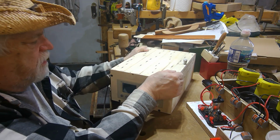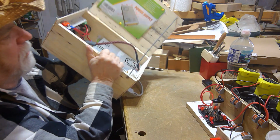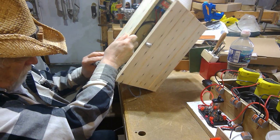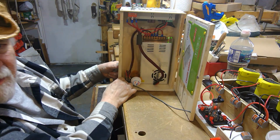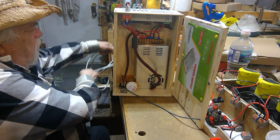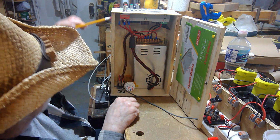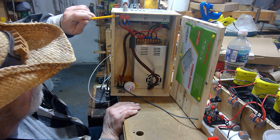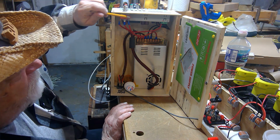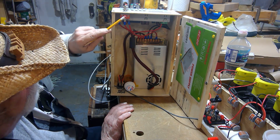Let's take a quick look at this wiring diagram first. So let me turn this way. Okay, we have to unplug that. And I think you can see that okay. So what we have here, quite simply, is I have the switch right here. It's a double pole, single throw, or whatever it is. I have two powers on it. The center goes to the load. So this one goes to the meter itself on this switch.